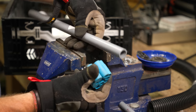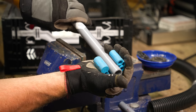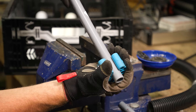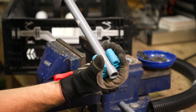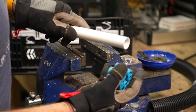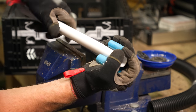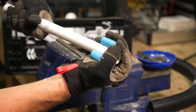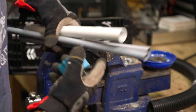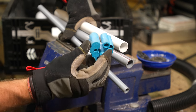So what about the C1 on a little bit of 22 mil poly pipe? Pop that on there like so and I'm just going to twist. Look, I want to show you - look at that cutting in there. How quick that cuts in. That's already off. We've got some electrical conduit here as well. I'll just pop that in there, press that down like so. We're right into that pipe now. Look at that - so we've cut three different sizes of pipe already just with this one product, the C1.